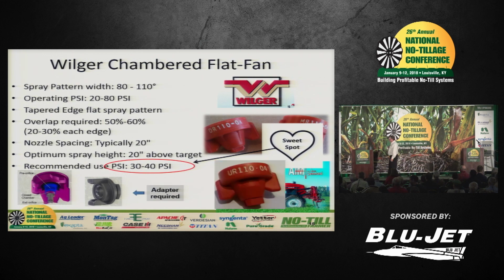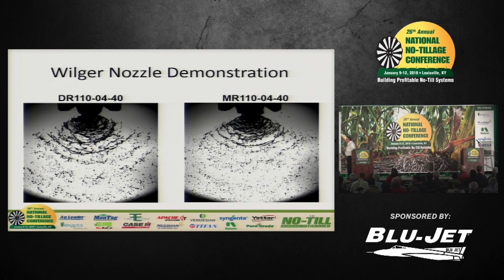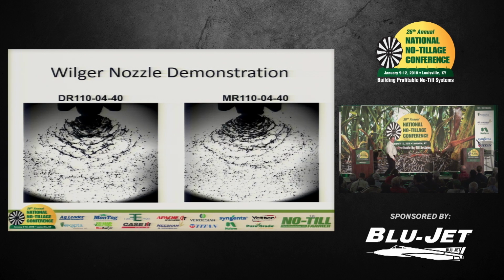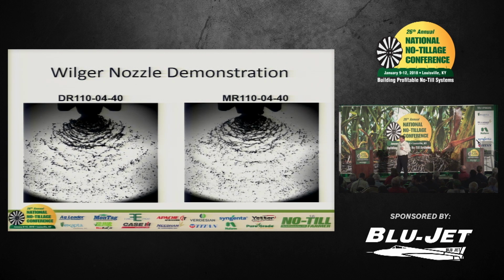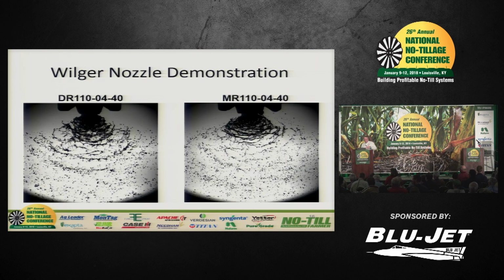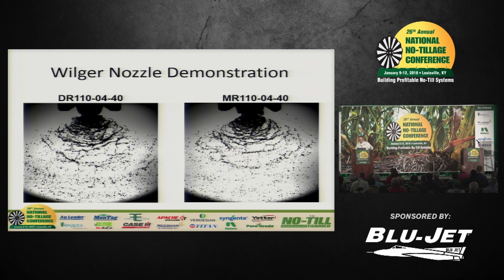Now, there's 2 versions currently, and a third one just released in 2017 for the dicamba market. So the DR, MR, and now the UR are their popular nozzles. And they have ER as well, but I'm not talking about that today. So on the left-hand side is the DR, on the right side is the MR, and you can get a feel for the drop size you're seeing there, which one would be better for coverage, which one would be better for drift control. And I don't have a video yet of the new UR, but it would be out on the far left-hand side of that screen in a bigger droplet category, based on the dicamba situation.